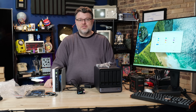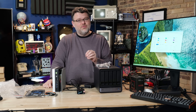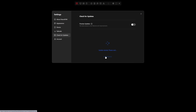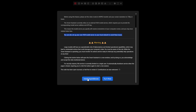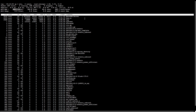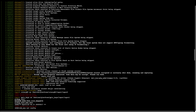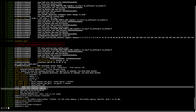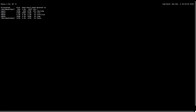You can also customize the screen and the application — it's a full Linux system, you can SSH into it and do all sorts of fun things. If you don't like the Nano KVM firmware, it is fully PiKVM compatible and you can install a completely different operating system. Under the hood it's about a gigabyte of memory and 32 gigabytes of eMMC — relatively modest, but I ordered three of these. When using this with the Level One Tech KVM for remoting in, you do have to use an option in the GUI that makes the HID a dumb HID mode, because the KVM doesn't support having all those endpoints for mounting drives. It is compatible with sending scroll lock, scroll lock 1/2/3/4 for selecting inputs on a KVM, which is fantastic.